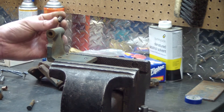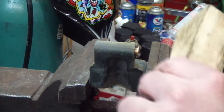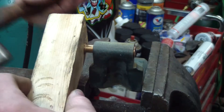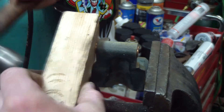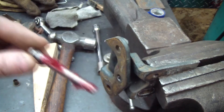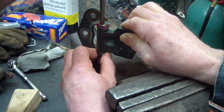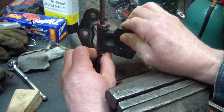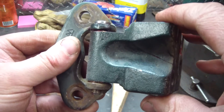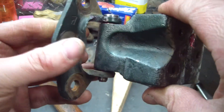Luckily the pin didn't wear through the bushing to the metal — getting a little close there. I'll try and tap it in with a wood block and a hammer. Here I'm going to send a new pin home — the end of it is knurled to grab on. There it's in. Here it is with the new bushings. There's still a little bit of play in it, but that's what they gave me and we're going to run it.